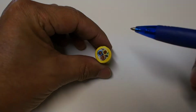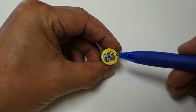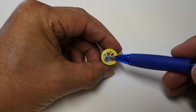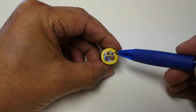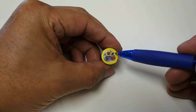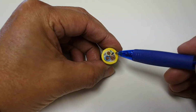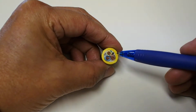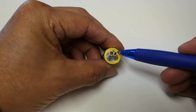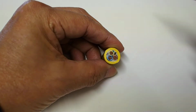Now, looking inside, you can see how those wires are placed. The main current wires are in the middle. The two control pilot wires are on the side. Most cables only have one pilot, but our generation 2.1 cables have a redundancy built in by having 2 wires.